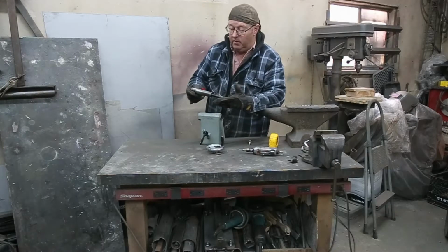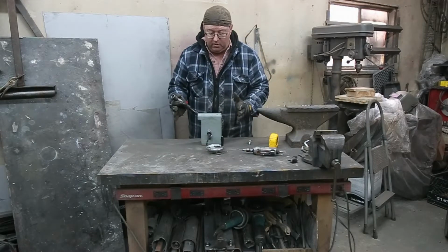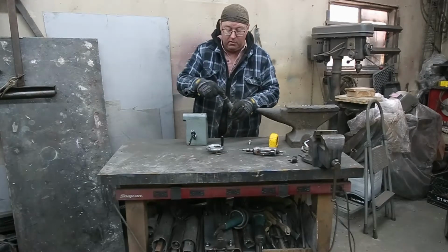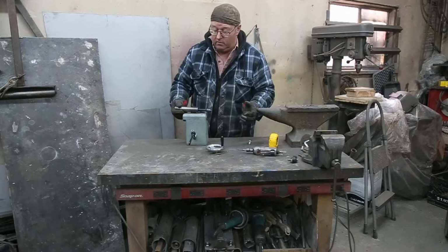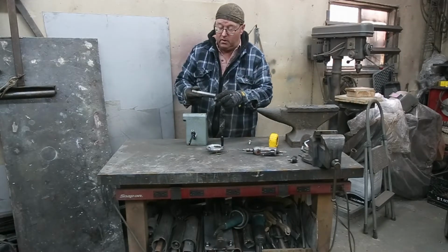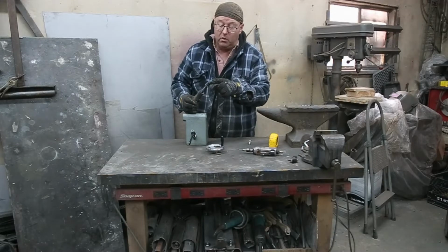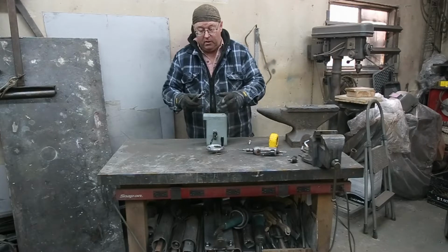Really, really can't. Now on the bigger tailstock, if you've got one of the bigger lathes, sometimes you have a little 1/4 inch rod poker, and this is a tapered end on this side, so when you want that out, you just tap it out. Well, this one here, the bolt's long enough that when you've got your taper in there, you just go back all the way and it just kind of pops out. So we don't have to worry about the hole, even though it's in there.